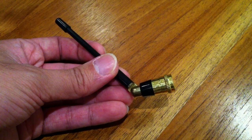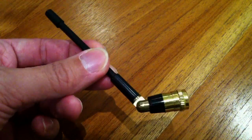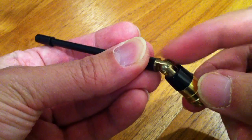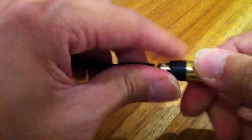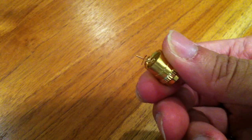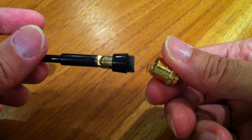Now that we are done exploring the transmitter portion, let's take a look at the receiver antenna. At a first glance this looks like a normal coaxial antenna, but it's not. The section here is actually the signal, so there's no ground element. And if you strip it apart, you can see a little helical. Basically this is just the signal, there's no ground.